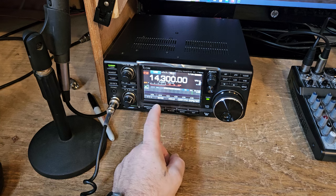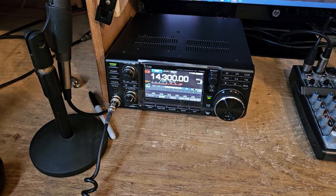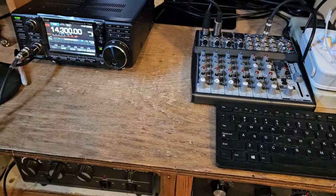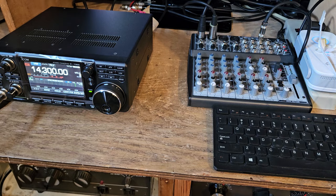Now, right now, we don't see anything because the antenna is not hooked to the radio, so it's actually only picking it up from outside. But what happens is the inverters radiate through your solar array, which in my case is in my backyard underneath my antenna. So when I go outside and I hook up this antenna really quick, you will suddenly see the noise. So give me 1 second. Might have actually disconnected the antenna inside too. Nope. That is very strange.